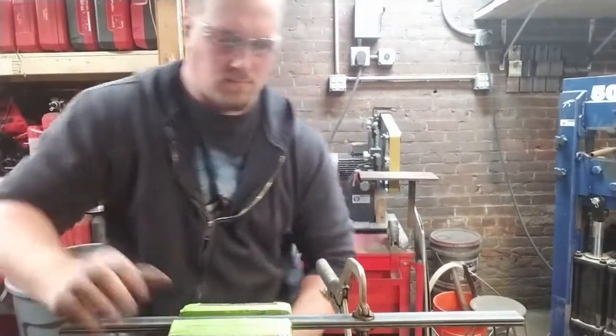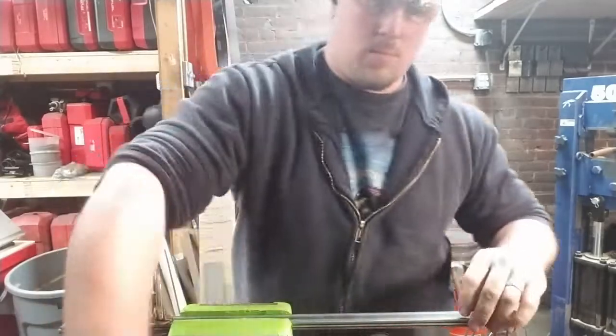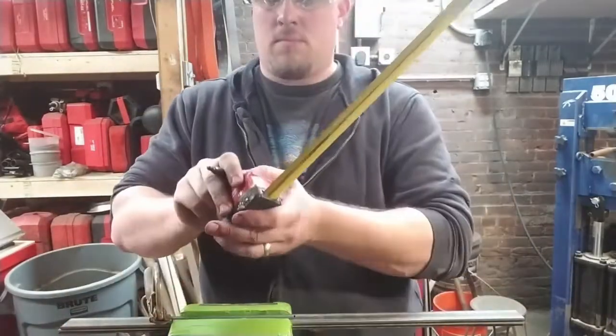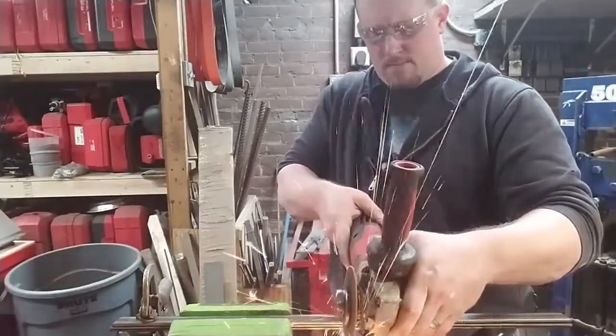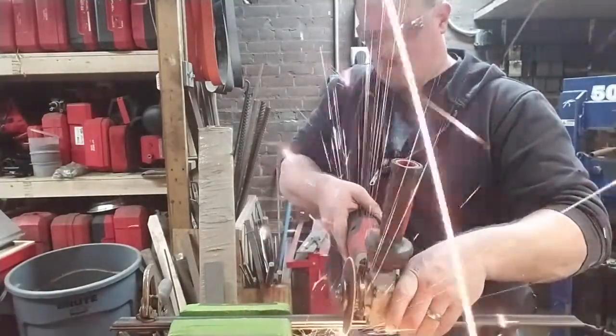Also, the temperature at which the iron is cooking really makes a big difference. The rate of carbon migration at, say, 1400 to 1450 is about half of what it'll be at 1600 to 1625.